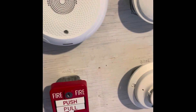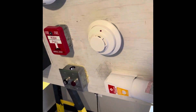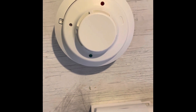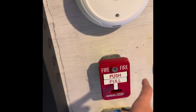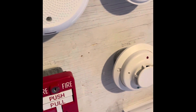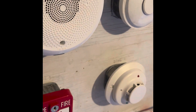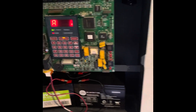I'm just waiting for it to cool down a little bit, otherwise it might go back into alarm. The i3 is blinking to indicate it has power. I think we're going to reset it now. With the pull station today, we're actually going to key-activate it — this pull station uses the Notifier key. There we go, the alarm is silenced. Now we're going to reset it.